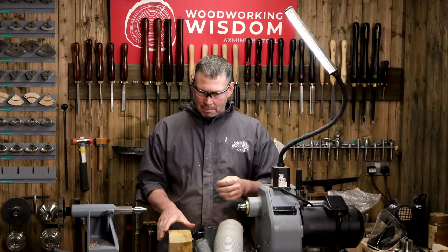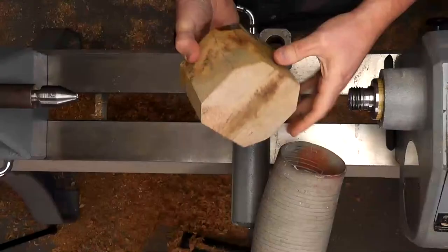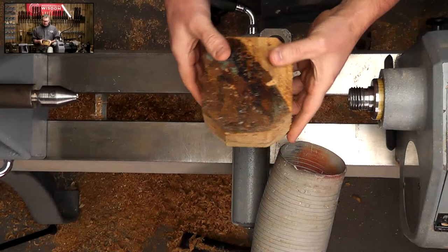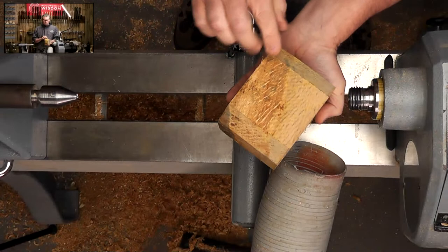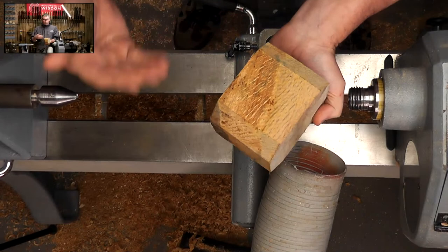The reason I wanted it was that it's a particularly beautiful bit of oak. It has really, really strong medullary rays in this particular piece. It also had quite a lot of burrs in there as well. The bit we're using today doesn't have that many burrs, but you can see the strong medullary rays creeping through it. It's a really nice piece of timber to turn. There's quite a strong difference between its sap and its heartwood here. When it comes to turning it, you'll cut through the sap much easier than the heartwood. There's far more sap running through the sapwood.